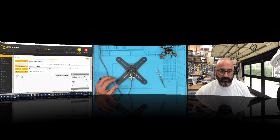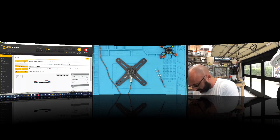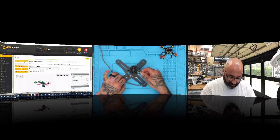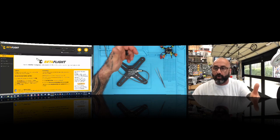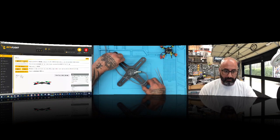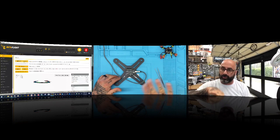Reset and calibrate — and we're back to normal. Now let's say you turn it upside down and also need to turn it negative 90 degrees. You still follow the same rule: go to Configuration and set the yaw adjustment to negative 90 with a roll of 180. Watch what happens — calibrate — up, left, right, down: perfect. Everything is set, no problems at all. All the orientation is correct.